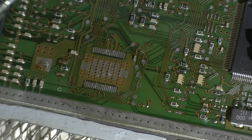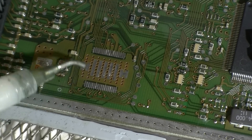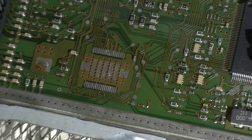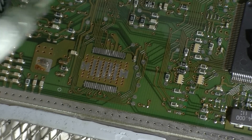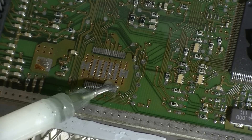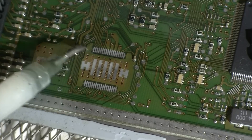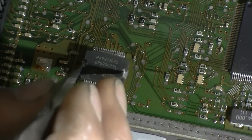Okay, so how are we going to do this? Because there's no solder mask in between these points here, I'm actually going to go and solder them manually — that'll be easier to avoid shorting together. So I'm going to just apply a little bit of gel flux over there, over there, over there. I'll just set up the other iron as well and we'll just place the IC underneath.